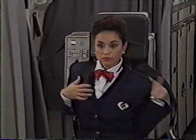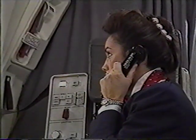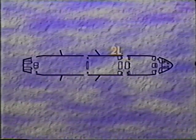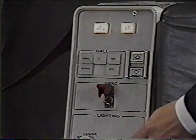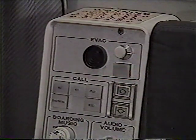For flight attendants to contact the flight deck in an emergency, pick up the handset, press the pilot switch at least five times, and press and hold the push to talk bar while speaking. Indications on the flight deck of this call are a series of at least five chimes. There is an evacuation signal system panel on the flight deck, at 1L, 2L, and 4L. In the cabin, the system can only be activated at 2L. To initiate an evacuation at 2L, lift the plastic guard and move the toggle switch up to on. This will sound the horns at 1L, 4L, and on the flight deck. Upon hearing the signal, silence the horn and conduct the evacuation.